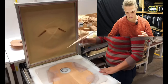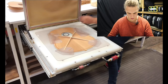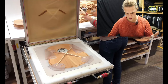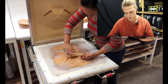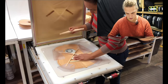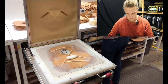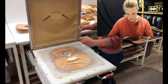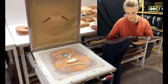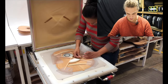This is the vacuum bladder or vacuum press for the top bracing. You can see the acrylic template there, so she doesn't really need to think about it — she just grabs the x-brace out of the bucket, waxes some glue on it, puts it into the acrylic template, puts the bridge plate in, then puts another side brace in. There's definitely space left on the acrylic down the bottom.